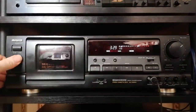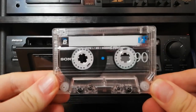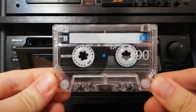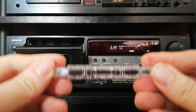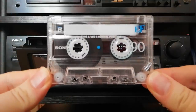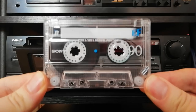So there's a lot of hiss on this tape, but I was recording that at +6 peaks. Plus six on an entry-level cheap ferric that's very black — the high hiss, the fact that you can take up to +6, says to me there's cobalt doping in this tape.